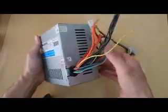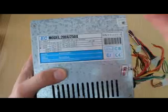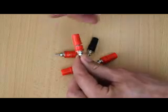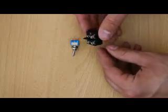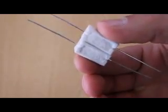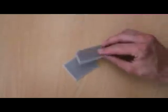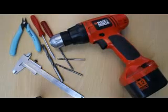Here I've got my old power supply — back in the day I was using it for testing power consumption of different motherboards. As you can see, most of its power is on the +5V rail. For this build you're going to need binding posts, a main switch and a low-current switch, dummy load power resistors, heat shrink tubing, two pieces of prototyping board, two LEDs and current-limiting resistors, and some tools.